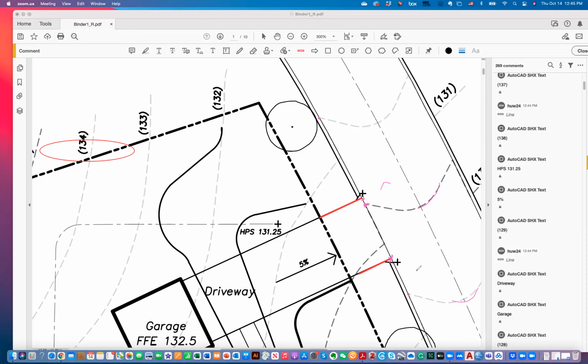I think, would it be like when we were doing, I forget which assignment it was, but when we had to figure out the distance between, right. So basically you would figure out the slope, right? So from 131 to 130 with that distance, you know the slope. And then you measure, okay, from that one to this contour, that's a very small distance, meaning that yes, that spot is very close to 130, slightly above 130. That's how you calculate the elevation there.